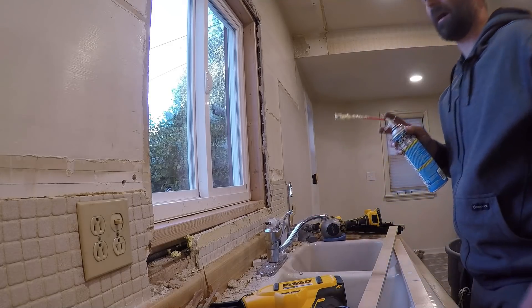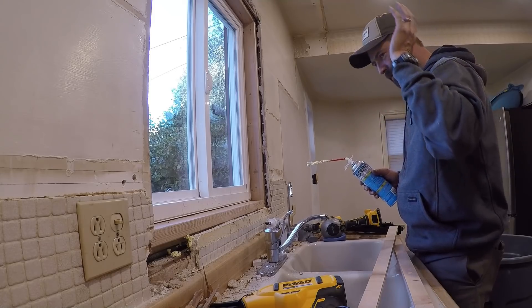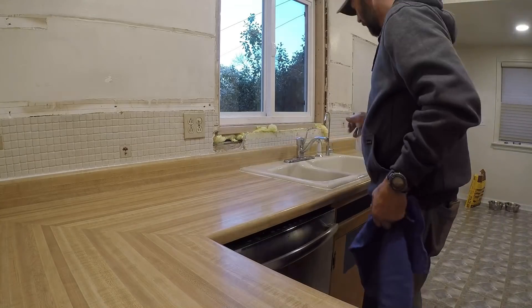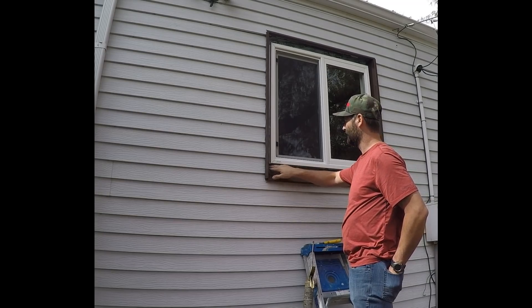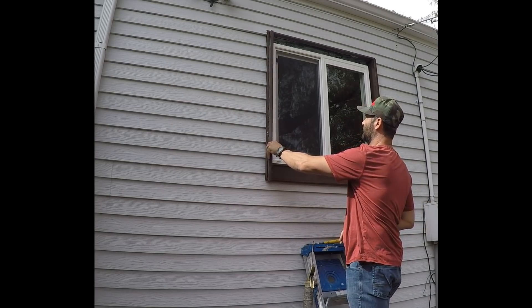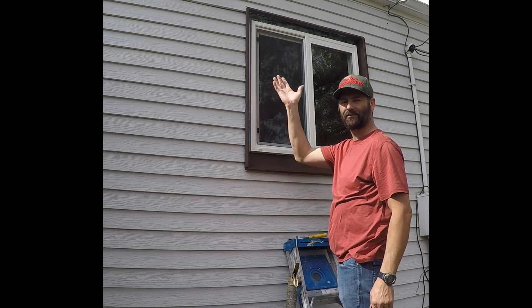We are all foamed in on the bottom. Now I'll take this outside and foam in around the new framing before I put the sticky stuff on and the flashing. I skipped past recording making all this flashing — it came out pretty good. Right now it's just kind of placed in there; I'm going to screw it all in then caulk it all in. Start at the bottom and work your way up so that it's lapped, so the water sheds off of it just like roof shingles.